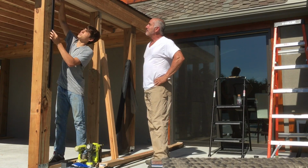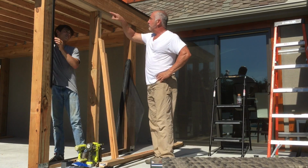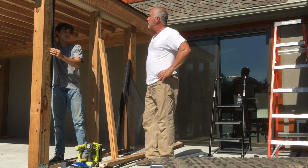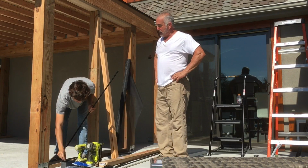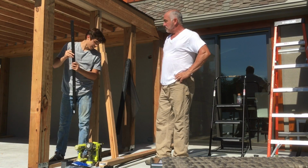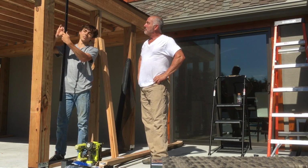And usually just butt them up against the top, right about where your ceiling would be. So there's no rounded track to fit your corners. Your corners are 90s? Right. Okay. And what kind of screws do you use to put those in? We use some drywall screws, and they work really good. You want to set your drill to about 8 is the setting that we have it at, and it stops perfectly, and it doesn't break through the plastic.